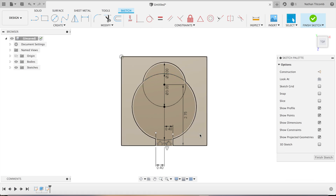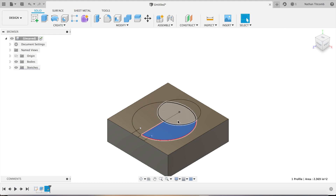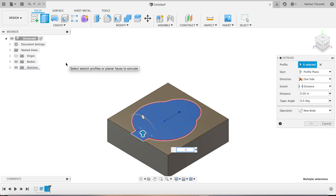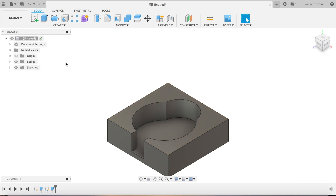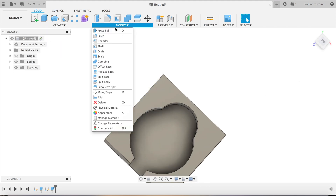Go up here — delete that. Okay, finished sketch. Now we'll extrude these sketches down — select all of them holding shift and clicking on the faces. Extrude minus one inch. Now we'll add some fillets to make the inside of the pocket deburred with no sharp edges.